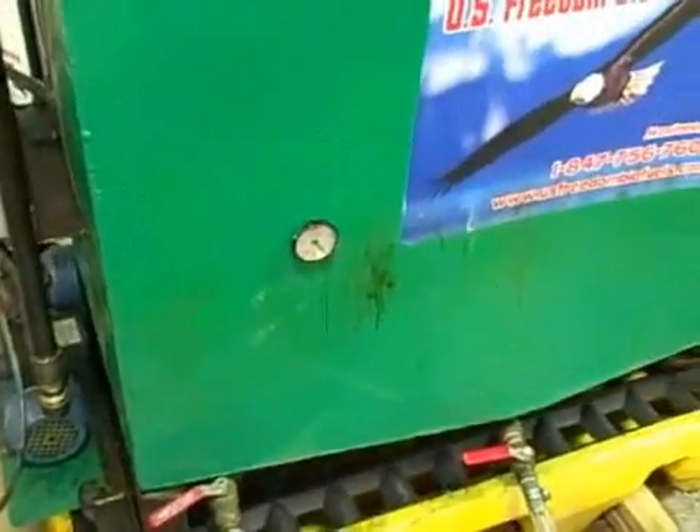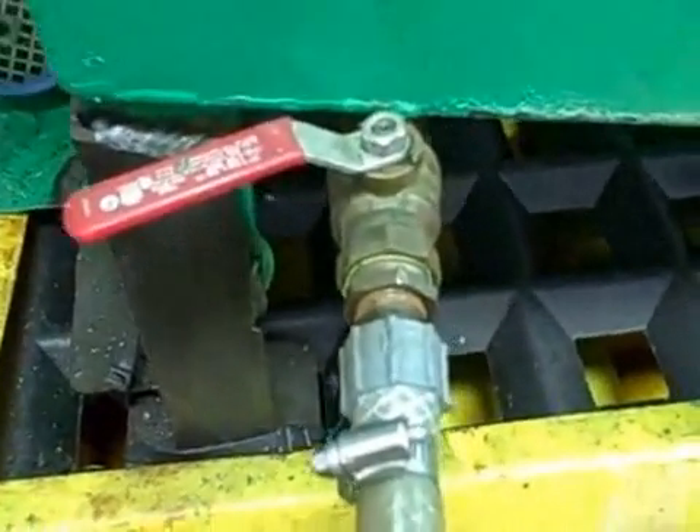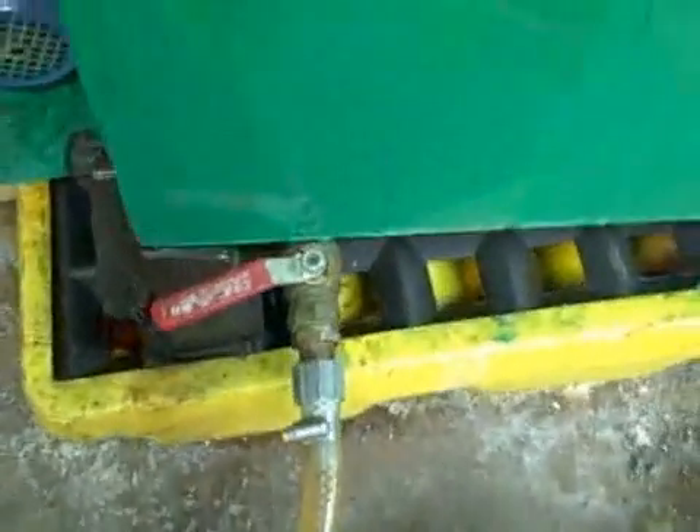We're back at the methanol tank, the settle tank. We've got our heat turned off — you can see the fuel is no longer rolling in there, no bubbles indicating any issues with our fuel, which is excellent. We look at our temperature gauge and we're at about 100 degrees Fahrenheit. This particular prototype, because it does not have a restrictor in it, we use this valve here to regulate the flow. The BD-40 or BD-65 that you would have would have a restrictor so that we can control the flow rate at optimum speed. We're going to go ahead and turn our valve to the open position, flip our pump on — we're now pumping our fuel up through the hose and into our storage tank.